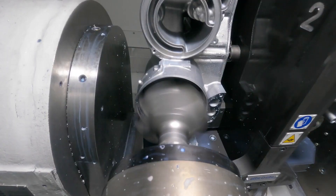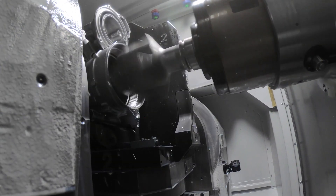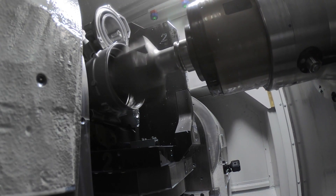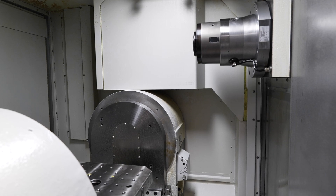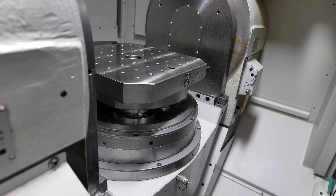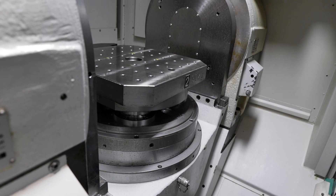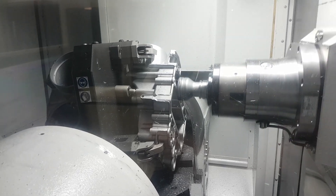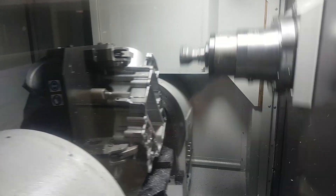And when you look at the portfolio of this type of machine, are there larger machines in the portfolio? Well, there is. This is the X40, so it's the smallest in the range. This is a 400 table size, and we go up to 500, 630 and 800 sizes on a trunnion configuration machine. So it's a very versatile system and you can have it configured for soft metal cutting very fast, or heavy duty cutting where there is a stiffer construction of the machine.